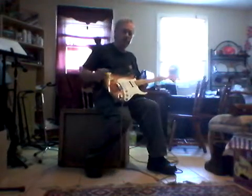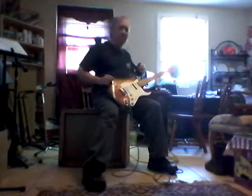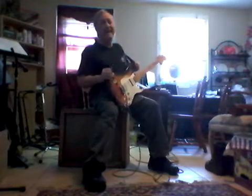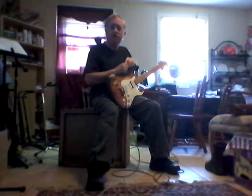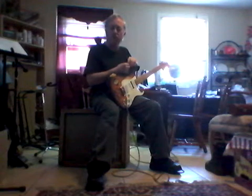There are harmonics on this thing because there's no negative feedback, there's nothing. It's just raw 2 6L6s operating in Class A mode. And again, right now I think I've got the voltage down to about 380 volts across the plate. There's a 300 ohm cathode resistor with 30 volts across it. So if you do the math, that works out to be about 48 milliamps of current. That means the tubes are running about 18 watts each, and it's really set up as a 35 watt amp when it was designed for the old 6L6 tubes. But I have 6L6 GCs in here, and they've got more power to them.